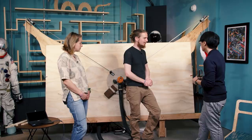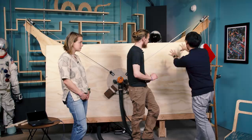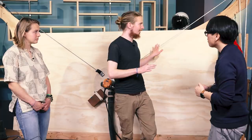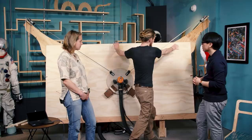With this two-axis system, are your cuts more precise in certain parts of the material, like toward the center? Because going toward the end is going to be more taxing on one motor than the other. That's a really good question. Our biggest thing that we didn't see as an issue before we started shipping — and it's actually a pretty big issue — is it has to very precisely know its dimensions to do the math, because it's very non-linear. We've been working through the process of how you set it up and do some test cuts to make sure the machine is precise everywhere. Our goal is plus or minus a 64th of an inch across the whole 4x8 sheet. Right now we can do substantially better than that in the middle region, but as you get to the edges, we're more like a 16th of an inch right now.